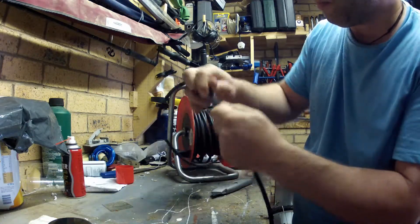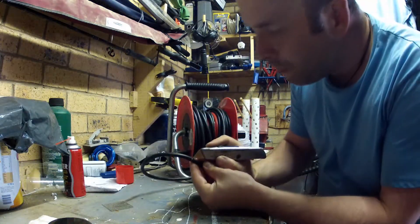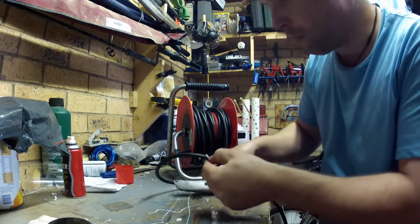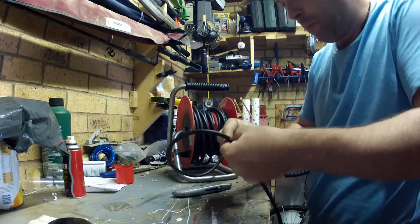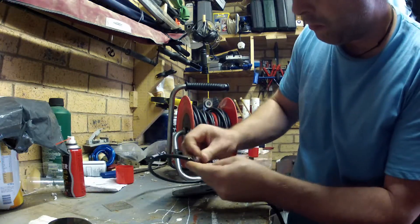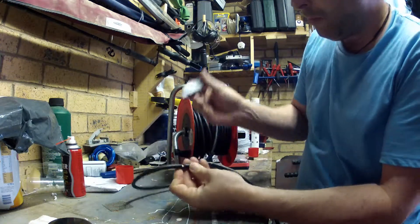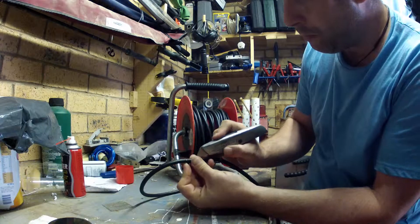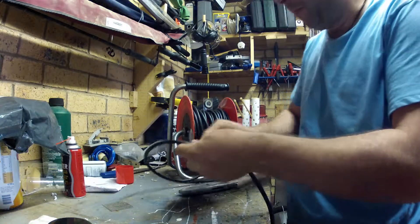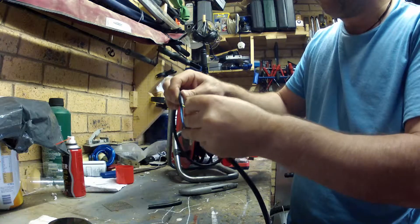You've now got two splits in the outer sheath. Mark a cut in the outer sheath about half an inch long and just get it started to peel back. Once you've got it started peeling back, just continue the cut — I'm not actually going right through, just about half a millimetre again, but stop short of the next cut. That way you don't skid off and hit one of the inner insulators. It should just now peel back very easily.